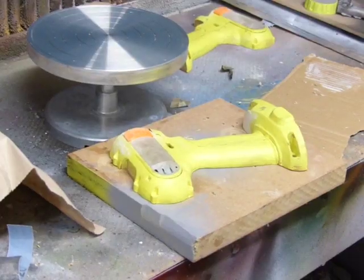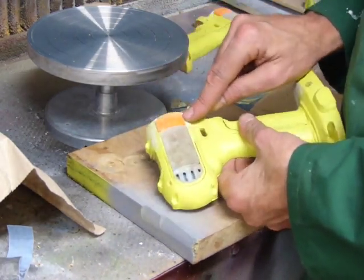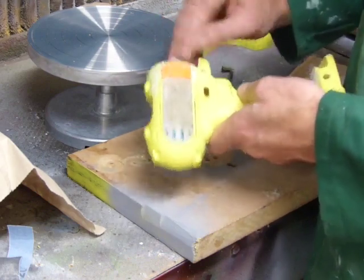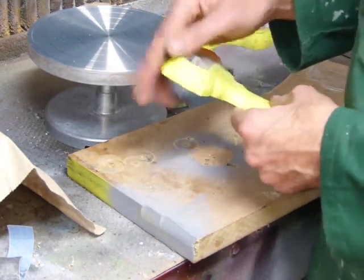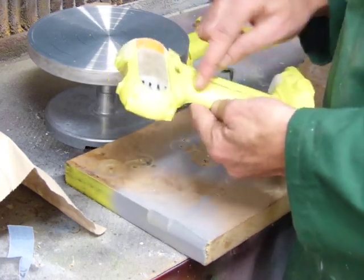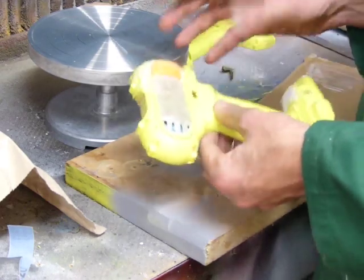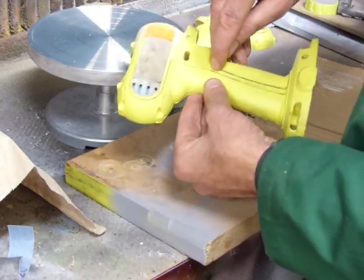Now at the stage where I've stuck down the detail parts, I've got these parts 3D printed. I just laser cut a little sliver the same diameter as this, a bit of trial and error just to fill in this extra gap. Bit of filler and just a general sand down. Some bits are a little bit rough. I'm kind of counting on the fact that these bits are like rubberized black plastic or rubber, so they're not going to be so critical to be smooth. Also acrylic, it's okay just to get a nice enough finish, but you've got to be careful not to get too many chips on where it's thick.